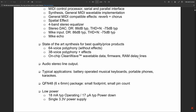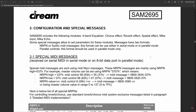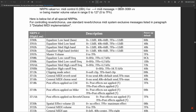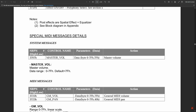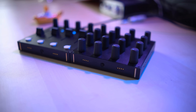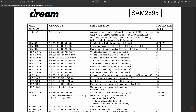The datasheet suggests the chip can be customized deeply using NRPNs and SysEx commands, allowing you to adjust effects, filters, assign controllers, EQ the sounds, and much more. Every time something mentions NRPN and SysEx, my Intech Grid controllers are the weapon of choice. Let's take a look at filter cutoff frequency for example. The manual confronts you with a cryptic line, so let's try to understand it and set up our controller accordingly.